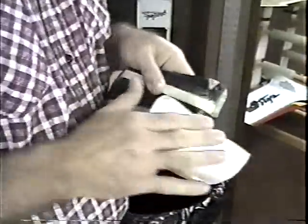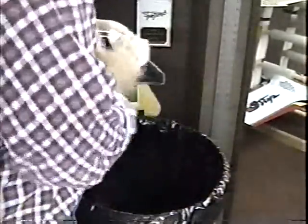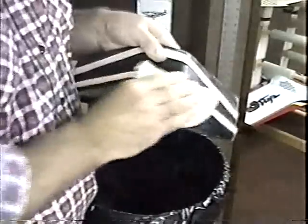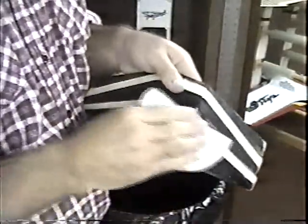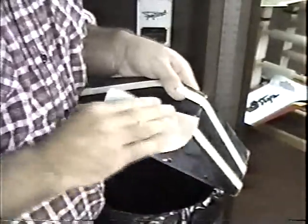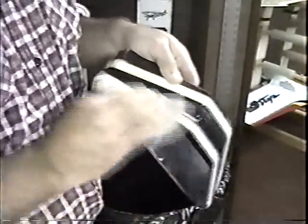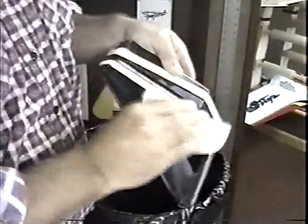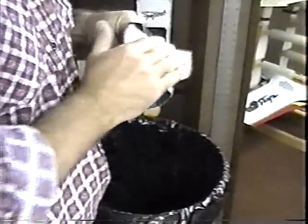Crude as these molds have been, or are, as the case may be, just by a little maintenance, and I'm talking about maybe half an hour on each mold, what happens is all the little overage gets over here and it pulls up chunks of material. And what I'm also doing, I took about 10 thousandths of material off one layer of a 3-ply. Took just enough material off that these later parts will be a little bit thinner.